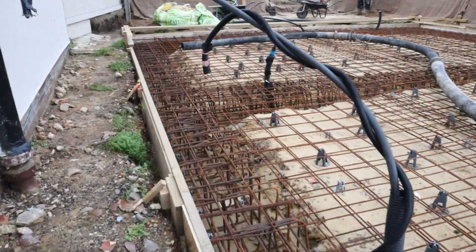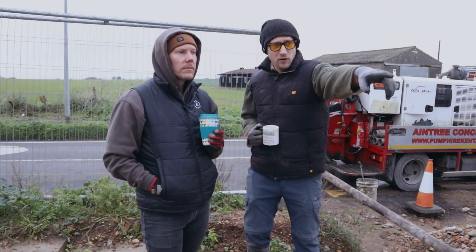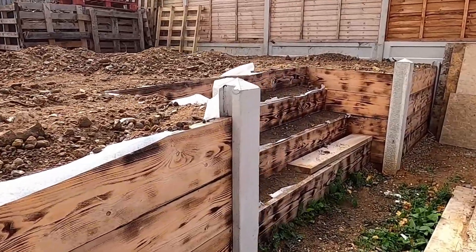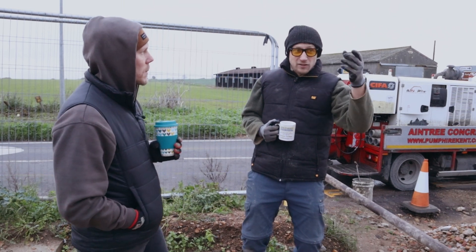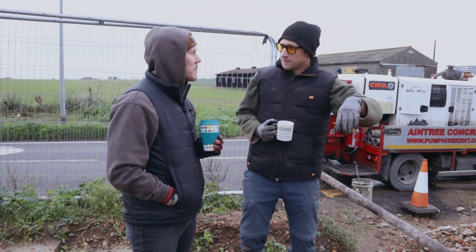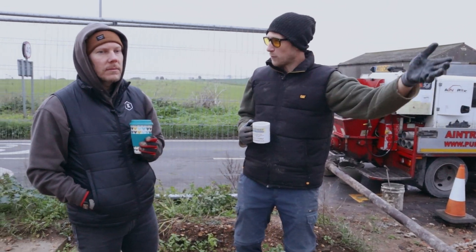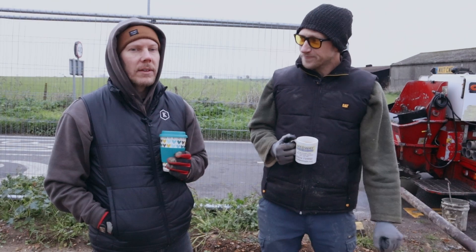You can see I've got the services poking up. I've got electric — a cable going to the back garden for some lights on the sleeper wall at the back. And then there's another little one poking up — that's going to be a temporary water drain so if this becomes like a swimming pool and starts flooding the slab, once I've built the plinth up, it's going to act as a little drain that runs out into the soakway.